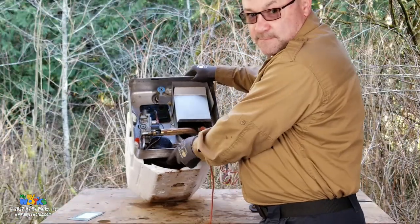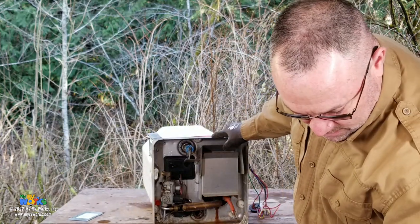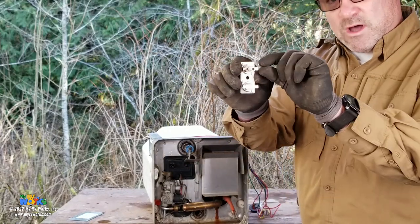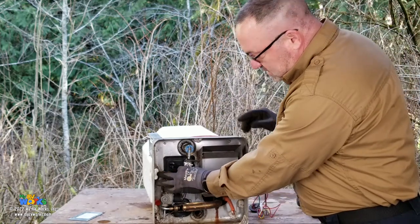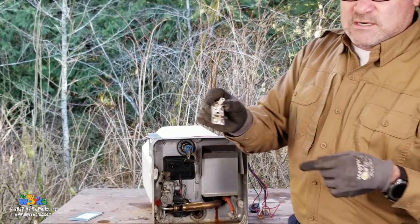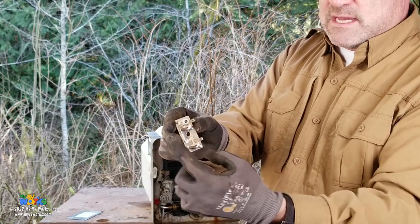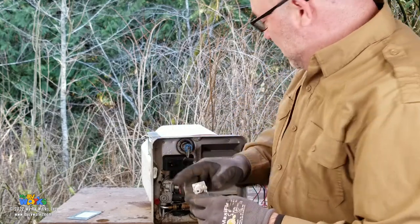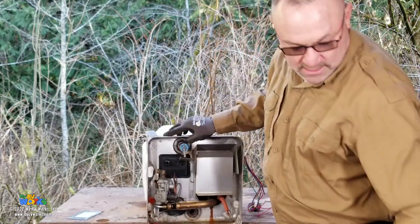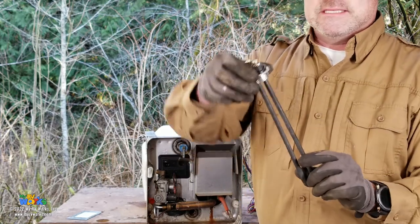So there's my switch. Okay, after I leave my switch, I'm gonna come up here to my, where is it? To my thermostat with the smaller prongs. He's gonna live on this half of my cover. Just like our DC, we're gonna come in on one, go through our 140 degree thermostat, come out through our 180 degree thermostat, and then after I leave this, I immediately come back down to my heating element. This is the heating element that is actually inside your water heater.